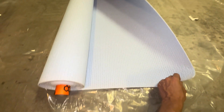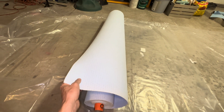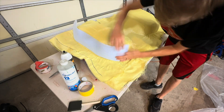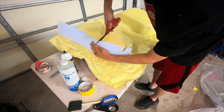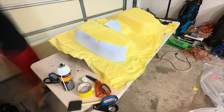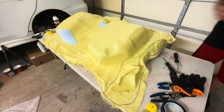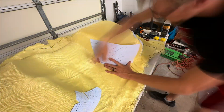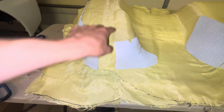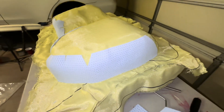This is the core material that I'll be using in the higher impact zones — to try and give the front and sides of the tank a bit more strength so the product will last longer. After creating this part and talking to people who have built these in the past, they said to use SORIC core material where I used foam core. Apparently SORIC lasts longer and has better impact resistance than foam. Here's the foam core — still left room for where the straps go, since you don't want to make that too big so the straps don't fit. But on all the high wear areas I used it.